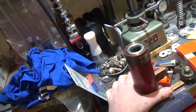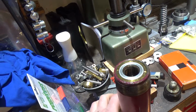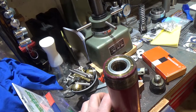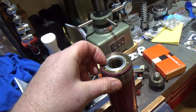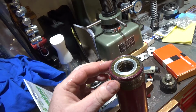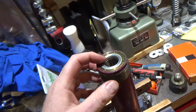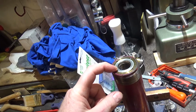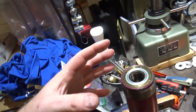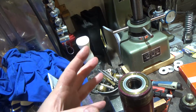Also interesting, I learned a bit about hydraulic pumps just in searching, trying to find more information, and it's fascinating the kind of situations you can run into when you're dealing with a hydraulic system. For example, with a motor-powered hydraulic pump, either electric or gasoline or some other power drive, cavitation can become a serious issue, where the cavitation will cause wear in the metal. Cavitation is basically moving a solution so quickly that the free gases that are diffused in the solution come out of solution, form bubbles, and then pop again.